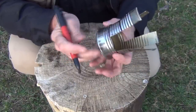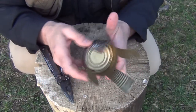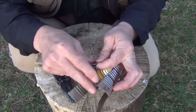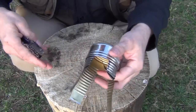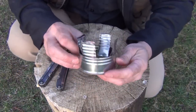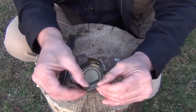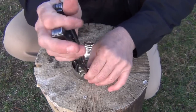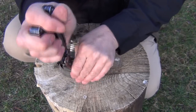It's very important that we get those all exactly the same. Now we want to bend these in. I would recommend that most people use gloves — my hands are pretty tough, so I'm fairly used to it, but you have to be very careful. Go ahead and fold in on that line, fold all the way down. I find it's useful to take a pair of pliers and crimp this on that line to get it a bit more accurate. If you've done this right, they should all be the same height, and that's very important because we want the pot to sit level. I like to pinch right here and put a little curve on the top of the stand — this seems to work pretty well. You can do this with pliers or just with finger strength; just turn it in a little bit to add a little extra strength.